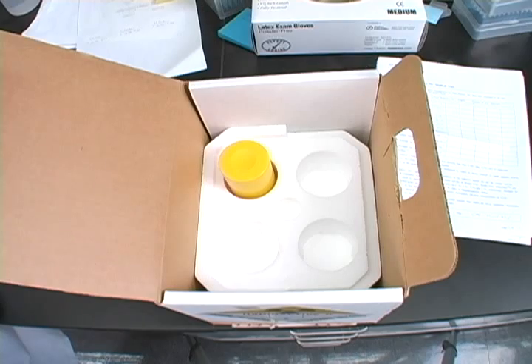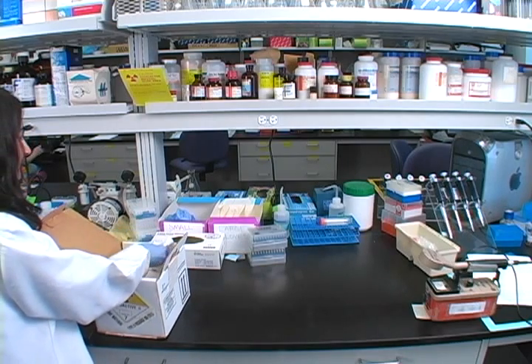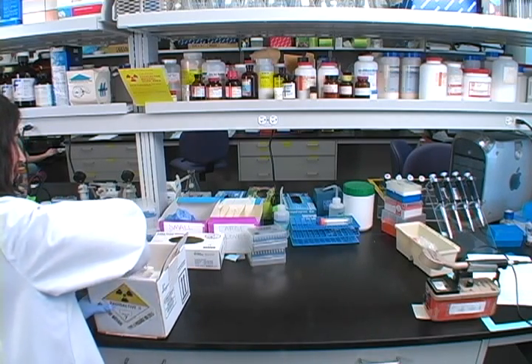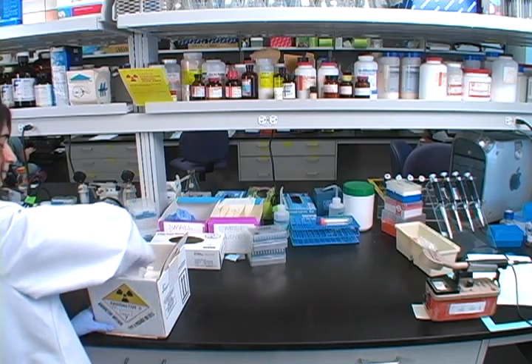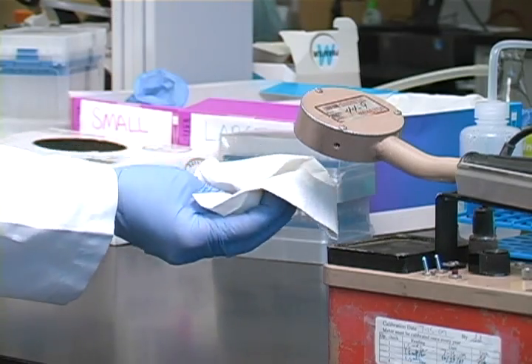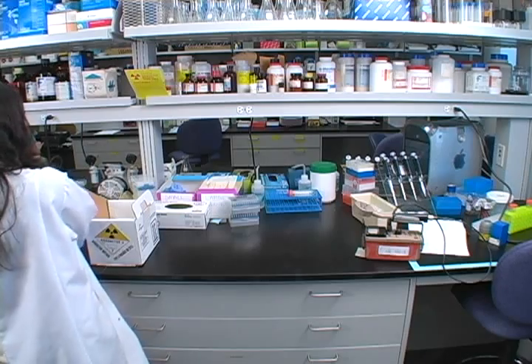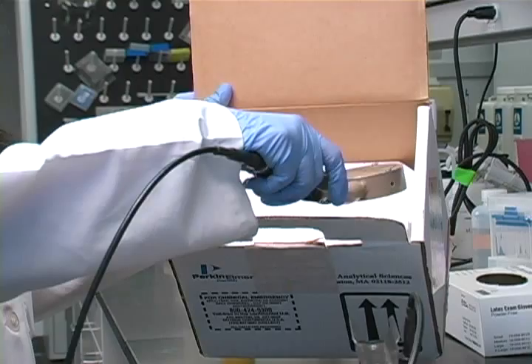Visually inspect the inside for leaks or discolorations that may be contamination. Krishna doesn't see any leaks, so she uses filter paper to swipe the inside of the package and the container holding the material, then uses a survey meter to check for contamination. The paper is clean, so she removes her material and checks the packaging away from the source to make sure it is not contaminated.